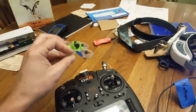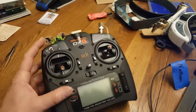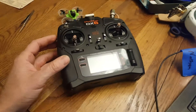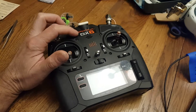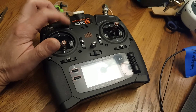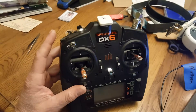Just raising the power compensates for that because you really don't have too many antenna choices. You could probably do a vertical antenna, have the antenna go straight off the bottom for better range, but it's so easy just to raise the power. With a Taranis there are tons of mods on how to raise the power, tons of videos on that. I like the Spektrum — it's legal, their packets are network friendly, even though I'm probably illegal on the power.